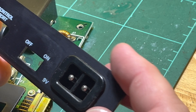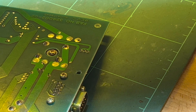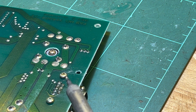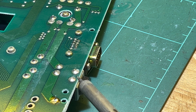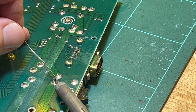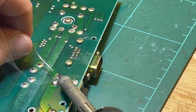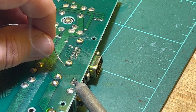Actually, let me reflow first. We've got two parts here - there's the bit at the front for mechanical strength, and then we've actually got the electrical part here. These are pretty easy to fix as well - if it's not working you can actually open them up, give them a clean, and re-lubricate. It's a pretty simple switch.